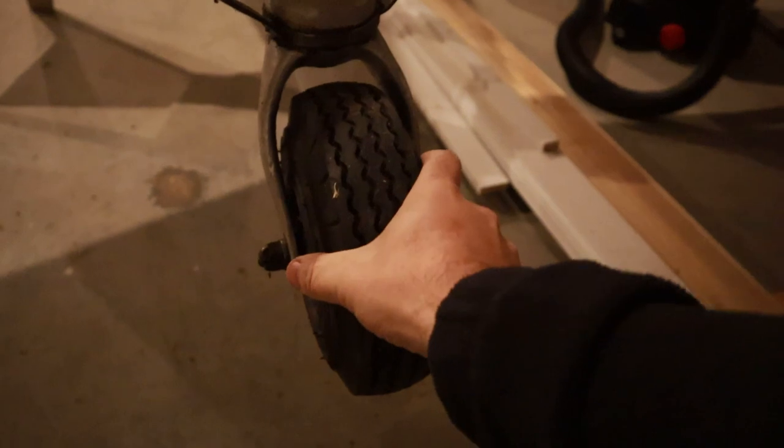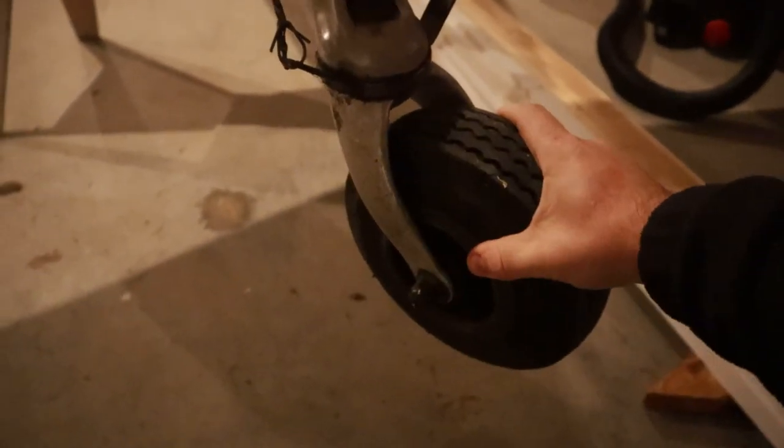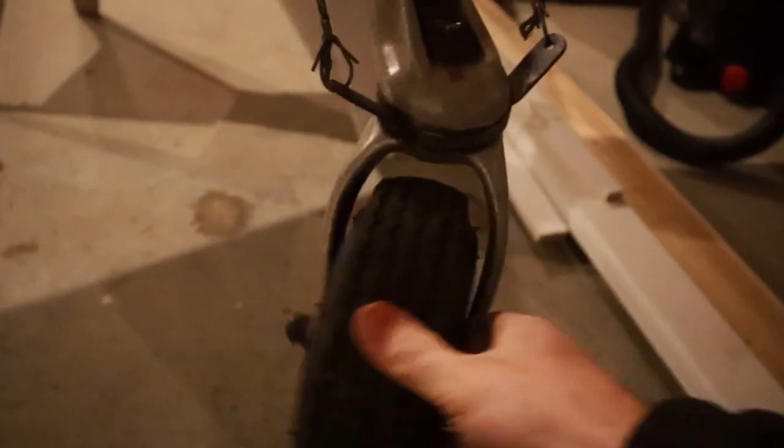I am gonna pull the tailwheel off. It's not locking, it's free spinning all the way around. So I'm gonna chalk the plane, put it back up on the sawhorse under one of the bulkheads, and then just take the tailwheel all the way off, take it apart, and see if something's broken or the casing's cracked. I know that these Scott 3200s will on occasion crack, the actual case itself.